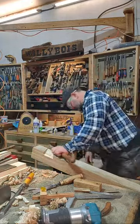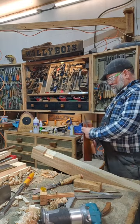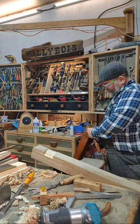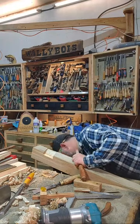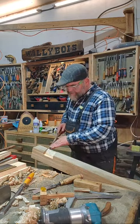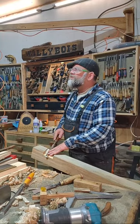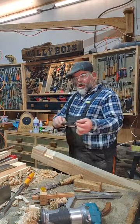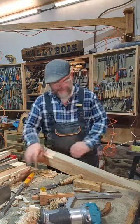Even my little wooden hand plane here, that's got a forged plane iron in it. It's two parts of steel, forged together, it's a process. They're really good, strong irons. Most stuff these days is stock, whether it be O1 or A2 steel, it's all different. They're good steels, but the whole thing is hardened steel, which can be a good thing, it can be a bad thing.